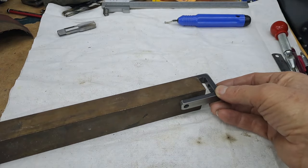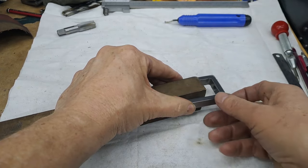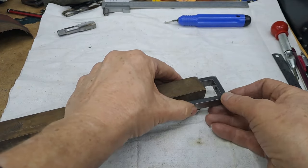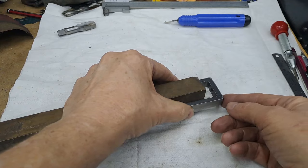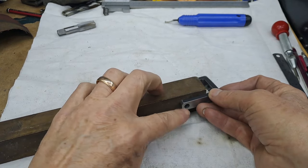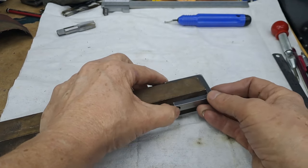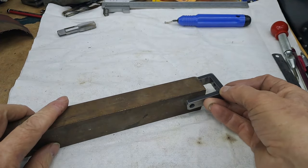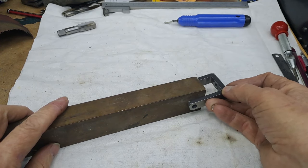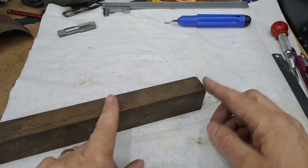We get a rotary motion from the eccentric on the driving axle, the coupled axle, and this yoke will then take that rotary motion and create a linear motion, because we have a couple of bearings to push into here yet, and a long pin to go through. And guess what? Once we get the pump ram made, it'll be doing this, and it'll become a working water pump. So we need 100mm of this.